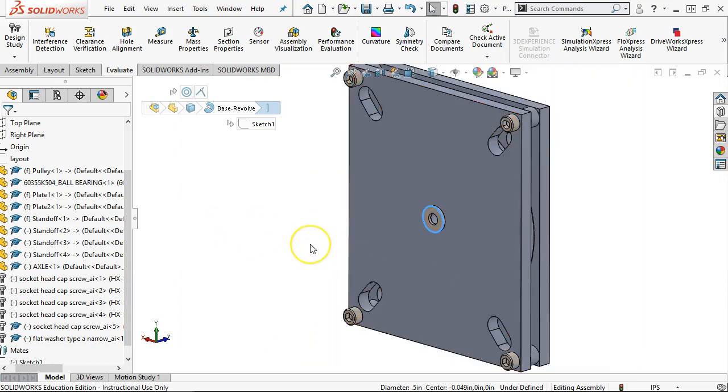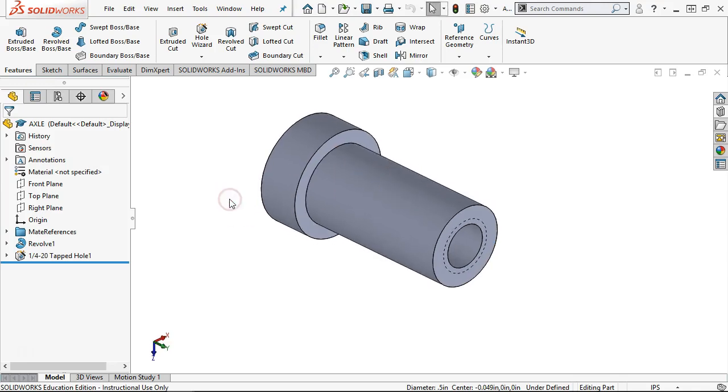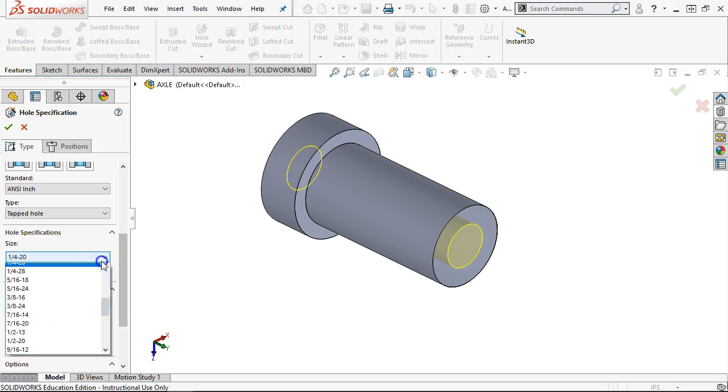So that being the case, well, we have another minor design change. So when I open this and you say, I'd rather just order a box of 1032s and be done with it. And because the length isn't that critical, well, they were 750. So I kind of got a little ahead of myself there. But if they're all 1032s, then I'm standardizing on the tooling and the tap.